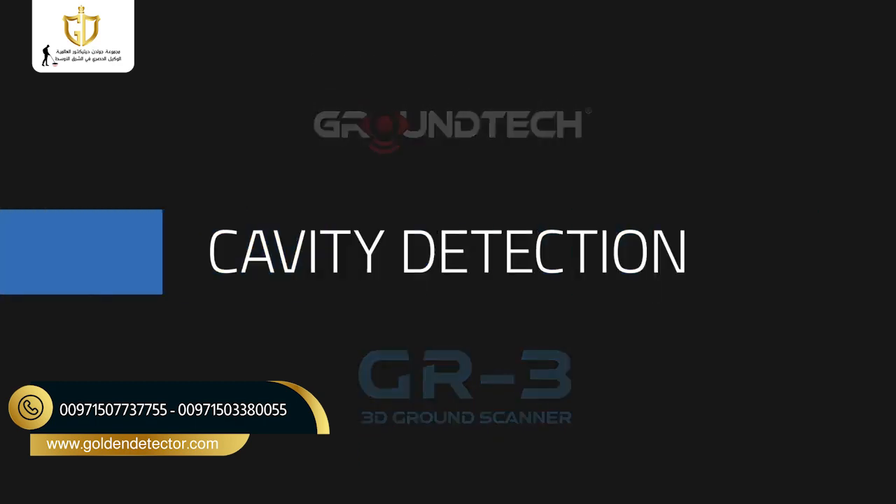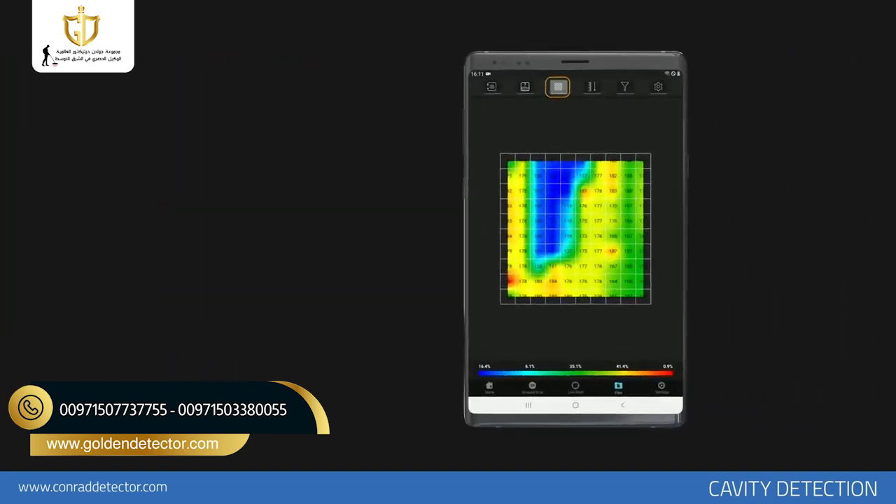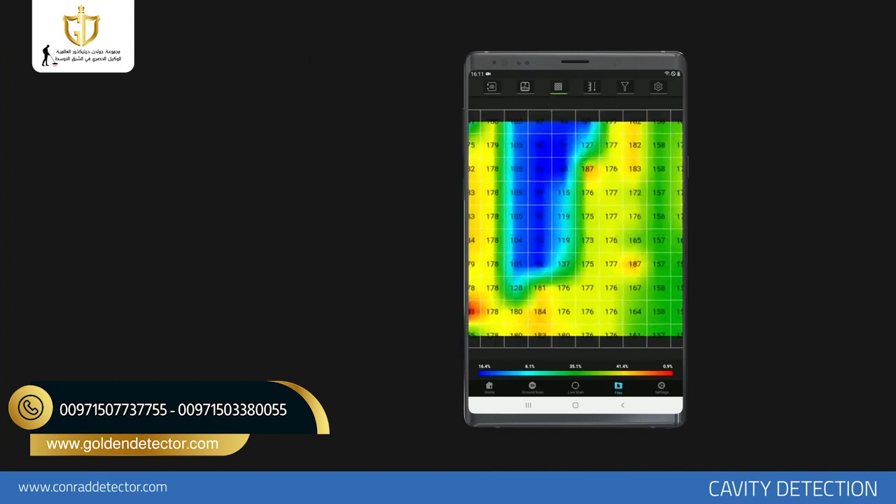Cavity Detection. Underground cavities such as tunnels, rooms, and graves that are artificially constructed underground are shown in blue. If any circumstances such as deflections or embankments are encountered in the cavity underground, cavity data will be shown in light blue, turquoise, and light green tones. A distinct shape in line with the search structure, such as a grave, should appear on the blue area on the graphic — it should be rectangular in shape and a size that matches a grave. There must be at least 15 points decrease between the soil shown in green and the cavity shown in blue. For example, if soil level is 130, a reading of 115 or smaller is required for cavity data. If the difference is just a few units, this data will indicate cavities formed by objects like rocks or superficial soil differences.